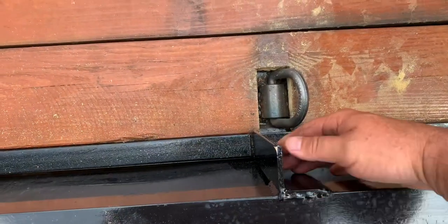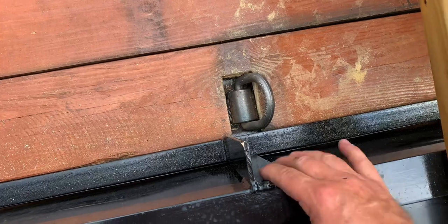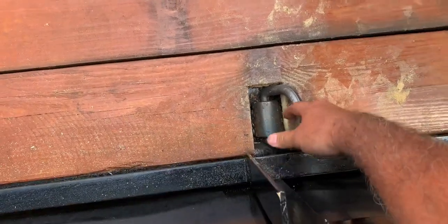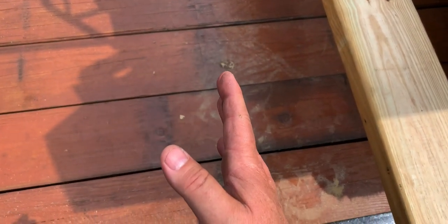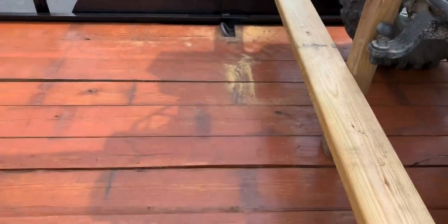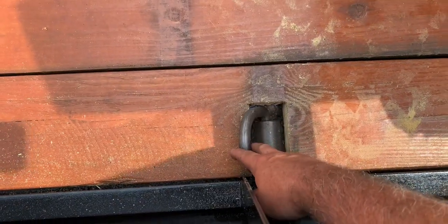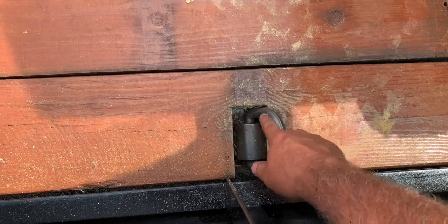See, now braced above the C-channel to here. On the inside of the fender, there's another one that comes up to this rail, so it's doubled right here. And the cross member right here, I put another piece back to back. And it's a double cross member between the axles, and that made it wide enough to buy this big heavy duty anchor, and it's welded to each cross member.